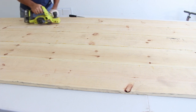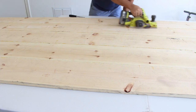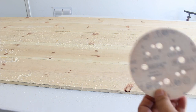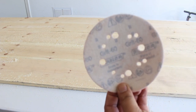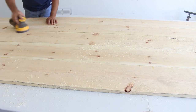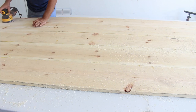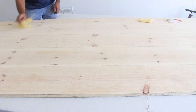I'm using an electric planer to plane the boards — it helps remove any extra glue and levels out uneven surfaces at the joints. Then comes sanding. I used 60-grit sandpaper for the initial pass, followed by 80-grit and 120-grit. Between sandings I used a tack cloth to remove accumulated dust.